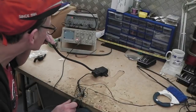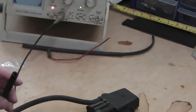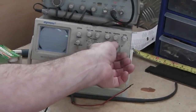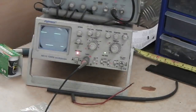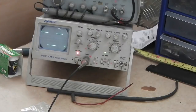On the tube. Yep, it's stretching. Let's bring you in. In fact, we can zoom you in so you can see a bit better when I draw vacuum on the tube. Now, I can see in the screen that that's scrolling across. Let me just see if I can lock you on better at that frequency, because the camera's shutter speed may or may not interface with the way that this displays. You've got sort of 50 Hertz on here, you've got your shutter speed, etc. Draw on the tube, blow into this tube. You can just see it changing shape.